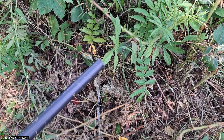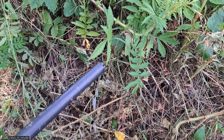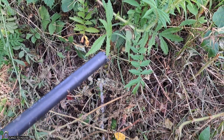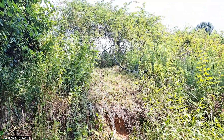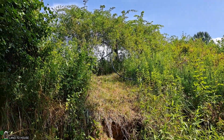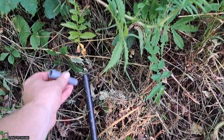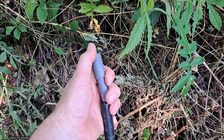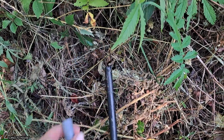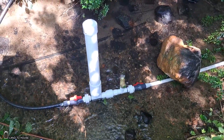The water has reached the top of the delivery pipe — you can see it is flowing. It's not a lot of water, which means I may want to increase the input head pressure by one or two feet to get more. I'm going to attach another section of pipe because we still have to get right up to that fence, so another 10 feet of lift or so. I've got an adapter to step up from half-inch to three-quarter pipe. It doesn't matter what size you use on the delivery pipe. While the pump continues to cycle pushing water uphill, let's do a full tour of the system.